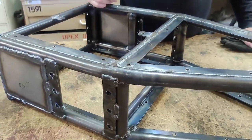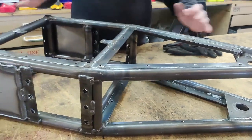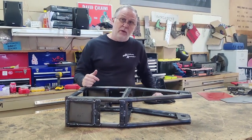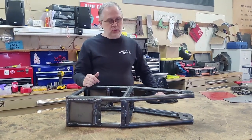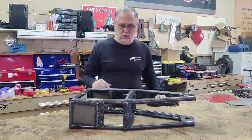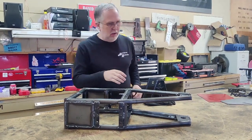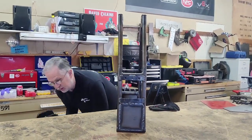We're going to use the titanium armor as both armor and frame support for this version. Between those changes and the general shortening of the robot, it should be significantly stiffer and stronger than before. That was one of Mortician's big problems — it had so much energy that the frame would flex and twist when it hit, and we could knock chains off and things like that.